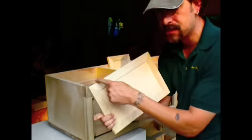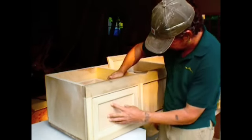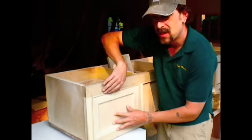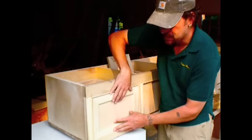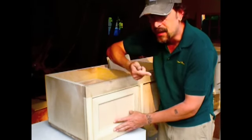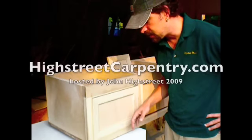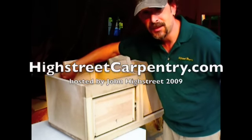On the back I have directions because this is custom-fit: left, right, top — you can figure out the bottom. It goes in just like that, and it's obviously perfect because I planned everything beforehand. There'll be a nice space in between because it's going to be a flush mount, and when it's painted it'll be nice and tight and perfect. The next phase is to flip the cabinet on its back, center these things, glue them, let the glue set, then drill through the back and put a couple of screws in to hold it permanently. Thank you for watching this portion of how to install drawer slides and drawers. Next week we'll do something different.